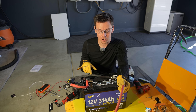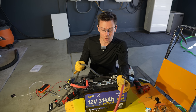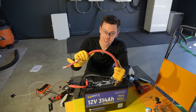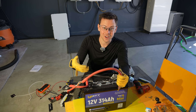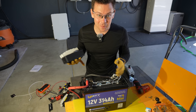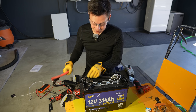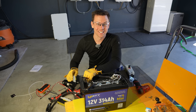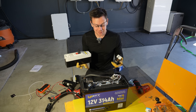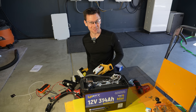A lot of 12 volt batteries without overcurrent protection — it's really hard to get over 600 or 800 amps because the wires heat up and resistance increases. Raw cells can produce thousands of amps, but carrying thousands of amps through a small BMS is very difficult. So these are fantastic, but probably complete overkill. Let's try to break some more 12 volt breakers. I thought this video would be quick and easy, but there are so many issues coming up. I could make a raw cell 48 volt battery, but I don't want to be near that thing. I could put a breaker in series so it trips first, but the knife switch to connect that is going to blow up — it's going to throw copper everywhere. This is a tough test.